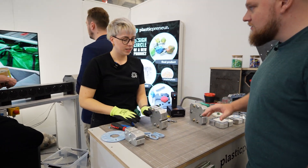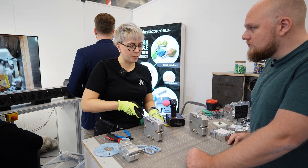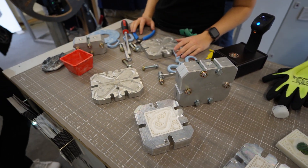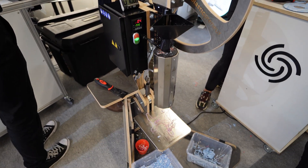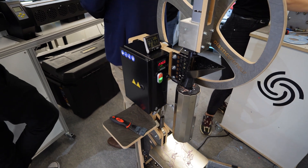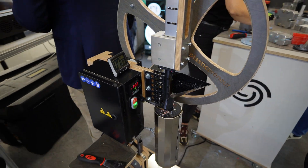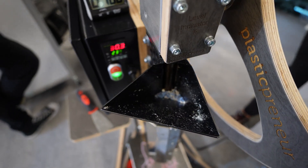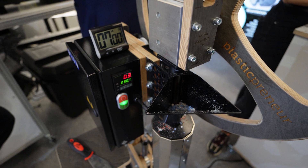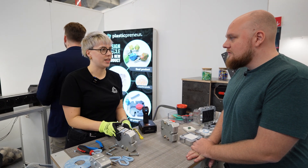This part is now really hot. The molds don't need to be preheated depending on the geometry — if it's a really large product we recommend preheating it once. Since the molds are all aluminum they retain temperature, especially after you've been injecting warm plastic repeatedly. We provide different standard molds in our catalog, and if you have your own product you can come to us. I'm the industrial mold designer — we design the product, create the mold, and manufacture it for you. Basically a one-stop shop.